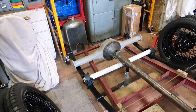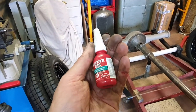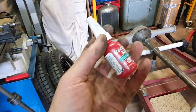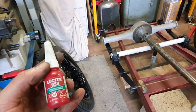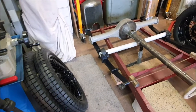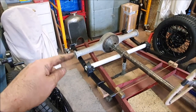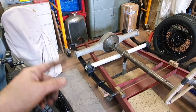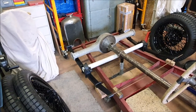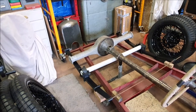Once I had them out I had to clean them up — even just trying to clean the loctite off is quite tricky. This is the stuff I was using: it's bearing fit, the high-strength stuff. It's quite goopy so it's really good at filling gaps. I ended up using a whole bottle. Once the pins were out, I measured everything carefully, wrapped tape around the ends of the tubes, marked very carefully where I needed to cut — multiple multiple times before I tried to cut anything — and when I was happy I cut through it with the angle grinder.